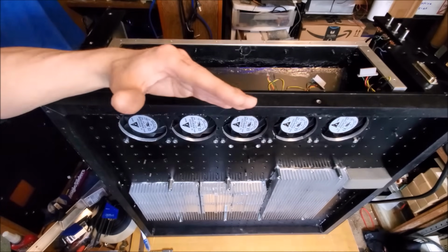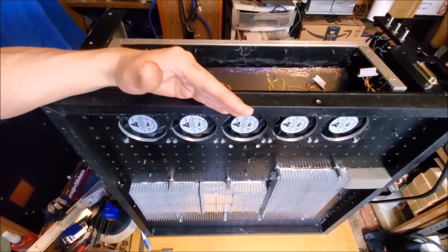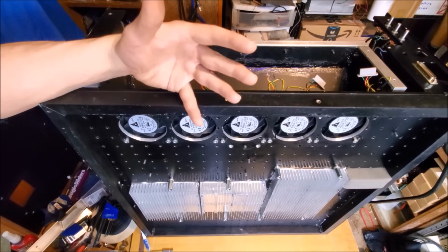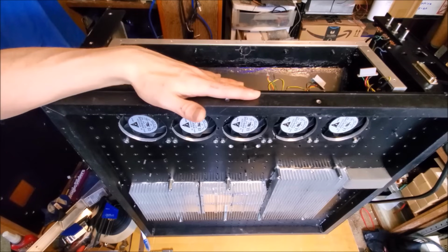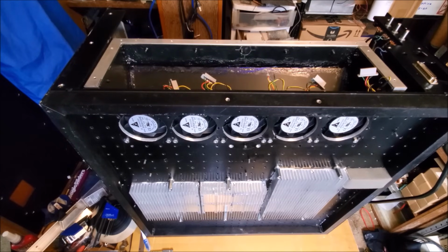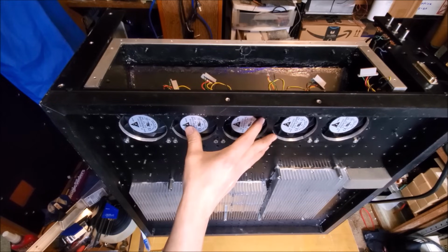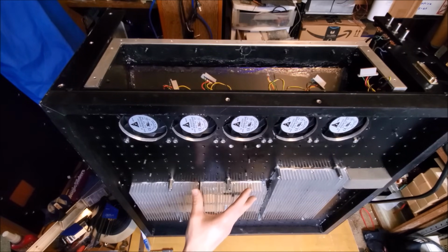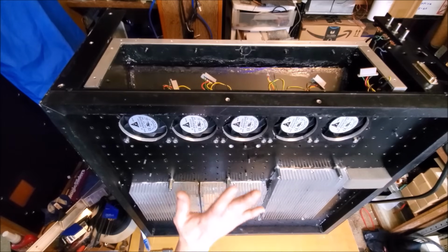At this point, I'm almost ready to move on to the wiring step of the project. But before I do that, I want to finish off the cooling and most of the structural aspects of the laser. The biggest thing to worry about, as far as that, is the plate that goes onto the bottom of the laser, which does two things. First of all, it's part of the active cooling solution because the air that comes out of the fans this way needs to be redirected so it flows across the heat sinks. The plate will do that.